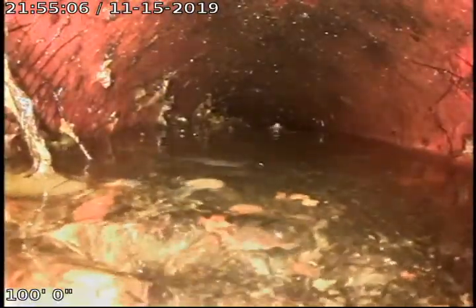It's difficult to tell, and until we get in here and we can hydrojet, we're not going to be able to see exactly what's going on. But we're going to shut all our water down now. Yeah, that all needs to be hydrojetted because the roots are just packed in there. It's holding water back. Okay. And I've got roots, I don't even know how far. Yeah, that's in the clay. That's in the lateral then.